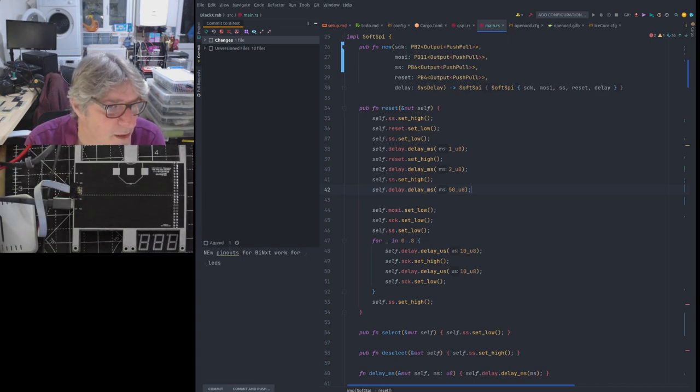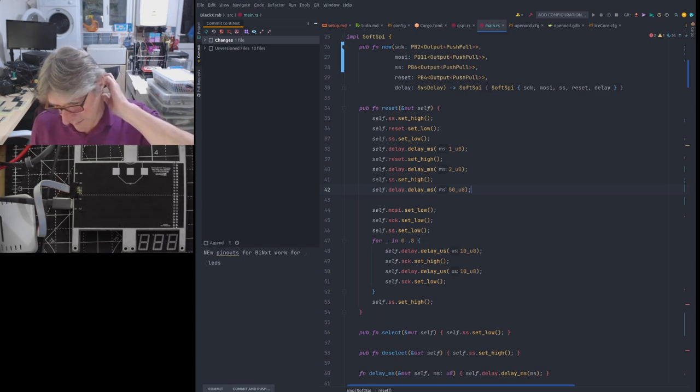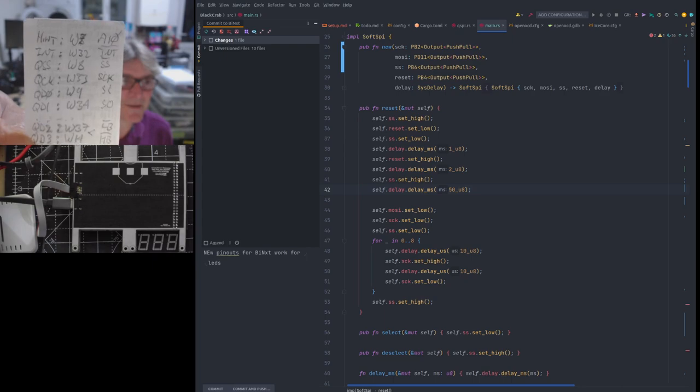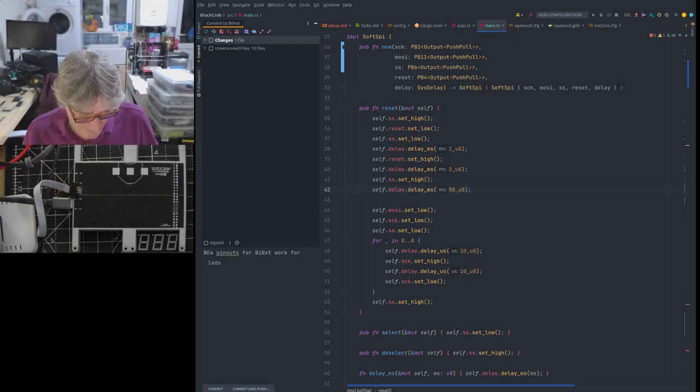Laurie says, which are the QSPI pins in the IRB schematics? I can see SS, SCK, SI, SO. Which are the other two pins? You have to look at both diagrams. I made a note of them when I was working on it the other day. Basically, yes, you can see the SS, the SCK, SI, and SO signals. Those represent the QSS, QSCK, QD0, QD1, and then the other two, QD2 and QD3, are actually the lower byte and high byte mask pins. Laurie, on that schematic, can you see those two? Those are the upper two bits of the nibble.